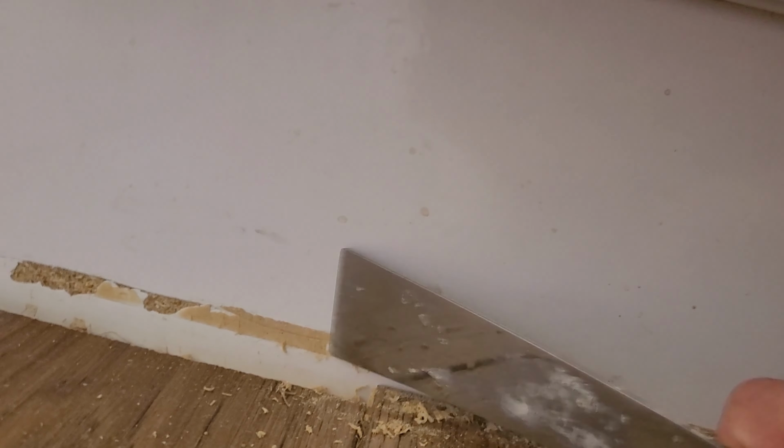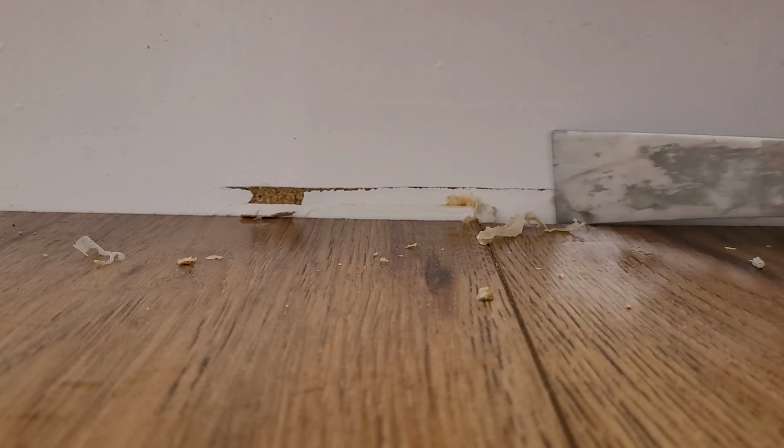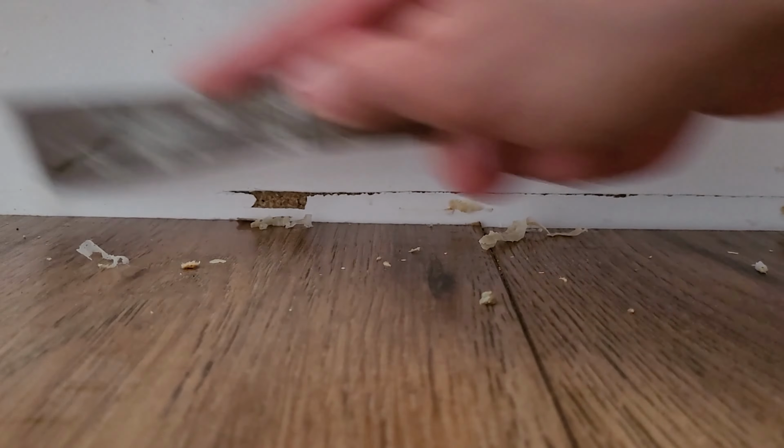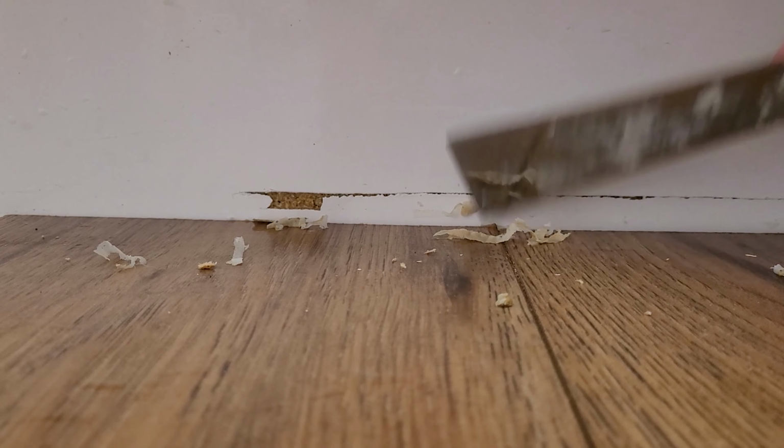Once the bulk of this moulding was off, I was left with an annoying residue. It was a mix of wood fibre and glue. I originally tried removing this by force, by using a putty knife, but my magical friend here was actually the biggest help. I worked some water into the residue and left it for 5 minutes. I was then able to scrape off most of the residue fairly easily. You might need to redo this step a few times, especially if there's lots of residue left to begin with, but overall it worked really well.